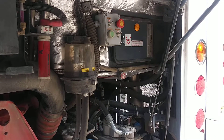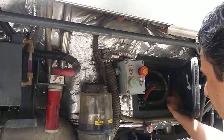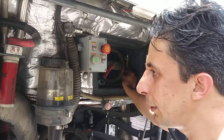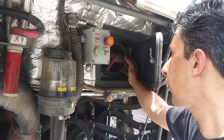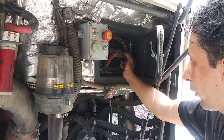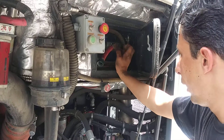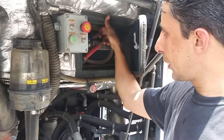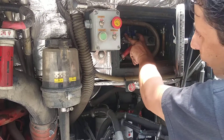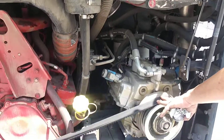For the bathroom fill-up, you fill it up in here. The level is right here — I usually hold it for about two minutes, then go in there and flush it. Some of them have a flush button right here. When you're draining your tank you can flush once so whatever is in the line will drain also. This valve — right now it's open. If it's at a 90-degree angle it's closed. Make sure your valve is open.